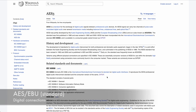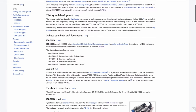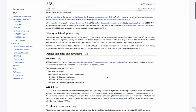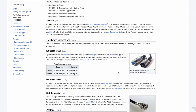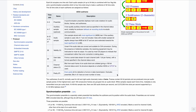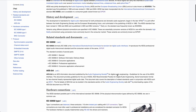One of the most famous digital interconnect types is AES, also known as AES/EBU — standing for the Audio Engineering Society and the European Broadcasting Union. They established a standard, now in its third version released in 2003. It was historically used more in the pro environment but is now present in many DACs. It's excellent because it's balanced, great for long connections, and usually uses an XLR connector, though it can also use BNC or D-Sub.